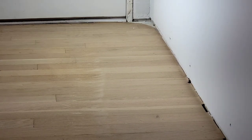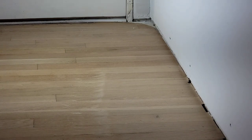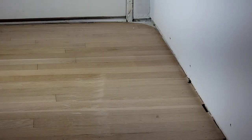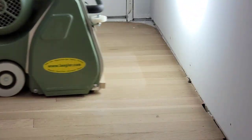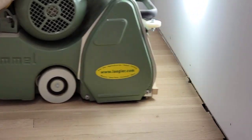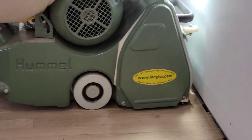Right here I'm demonstrating how close I get to the wall on either pass. You can get this close on the 40 grit and 80 grit depending on what you're using, but I get real close without bumping the wall — if you bump you might get a wave and you don't want that. And if you start seeing that straight line, that shows that you're doing it right.